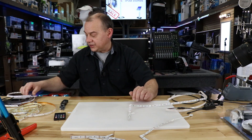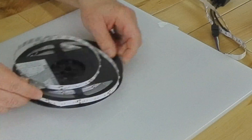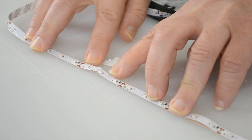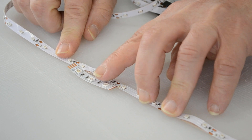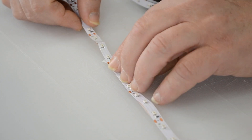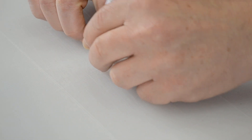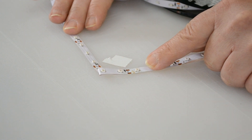Other strips work out pretty well. You'll see a lot of videos with this type of strip — your regular 3528 diode, single diode, 12 volts. We have three diodes with plenty of room in between, and the cut distance is the same. That's multicolor; this is a solid color — it could be white or anything. To make this happen, we've got to first bend it in one direction, then for it to come towards me, you fold it right back on itself. And there you go — I now have that done at 90 degrees.